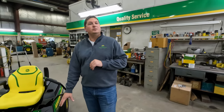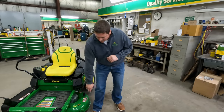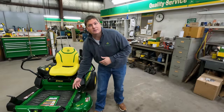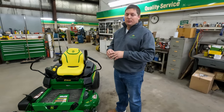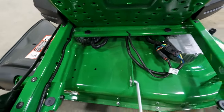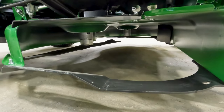So let's talk about the mower deck. On this particular unit it comes with a 42-inch Excel deep deck. It's got two front anti-scalp wheels — one on the left, one on the right — each with four individual height-of-cut adjustments. It does come with a washout port. The 42-inch deck is a stamped deck, 12-gauge steel. There are no belts and no grease zerks, so no service points or wear points on the mower deck. The only maintenance you'll have to this deck would be to sharpen or replace your blades.